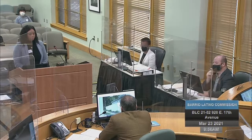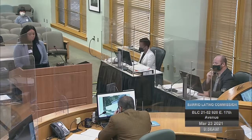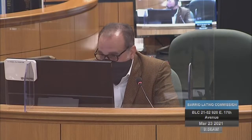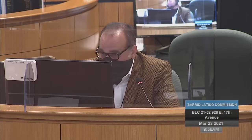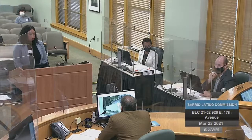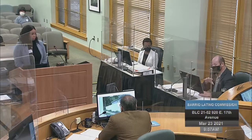The fence as installed meets City of Tampa code. The code states that in the front yard, if the fence is transparent, as this one is, the picket provides that transparency, it could be up to 4 foot in height. And then towards the rear, you can have a privacy fence, and City of Tampa code for the side and the rear behind the front yard setback can be 6 foot in height. It could be 8 foot, actually, in certain zoning classifications, but in residential, we hold it at 6 foot. Okay. So really the issue is the materiality, more so than the height and the opacity of the fences? That's correct.